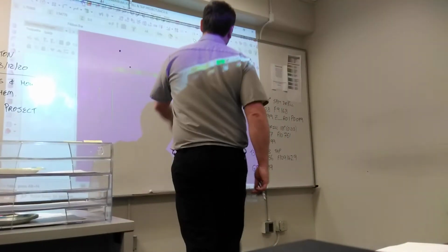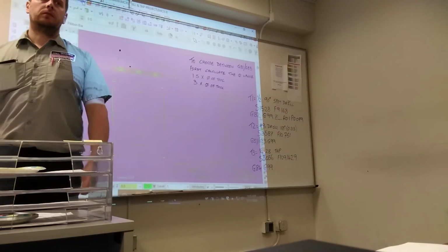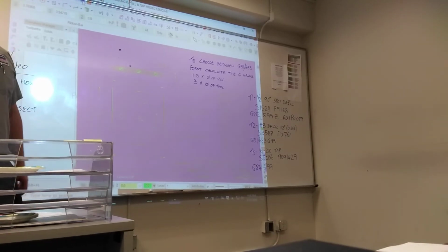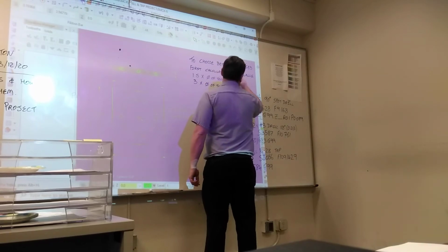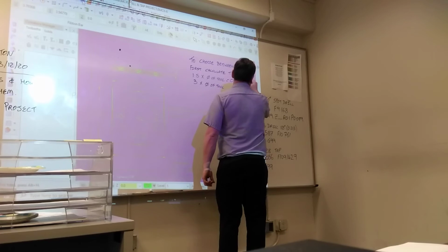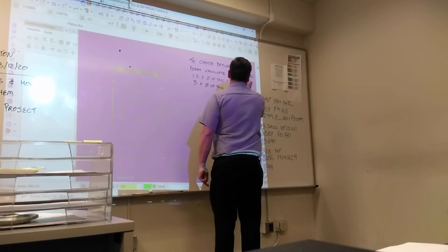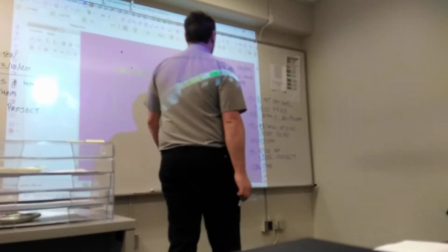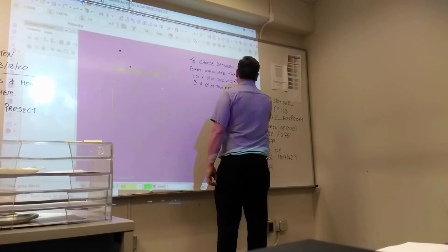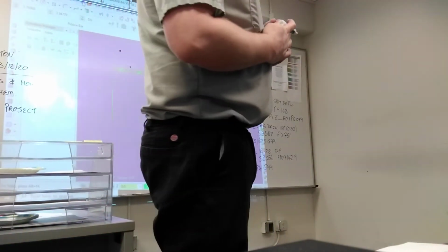So if you do 1.5 times 0.213, what number do you get? 0.3195. If you do 3 times the diameter of the tool, you're going to get 0.639. So your Q needs to be between those two numbers. That's what the formula is telling us, right? Everyone agree?